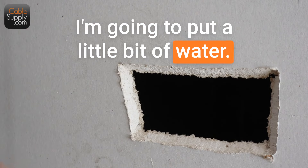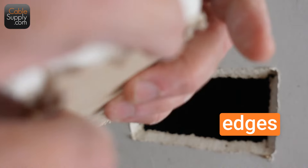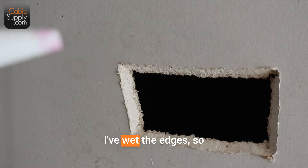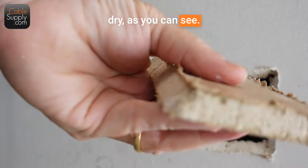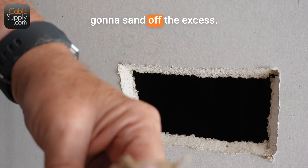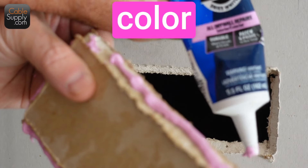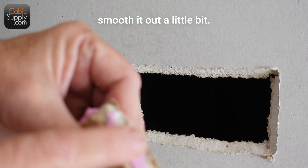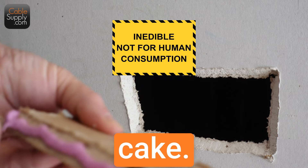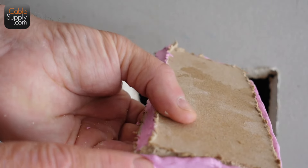Now I'm going to take this and put a little bit of water on these edges. Just a little bit of moisture on these edges, and then I'm going to put a little bit of repair spackling on it. I've wet the edges so they're not bone dry. I don't care if it's messy in this area because I'm going to sand off the excess when I'm all done. I like these little tubes — get them at Home Depot, places like that. I like the fact that it has a pink color when it's wet and dries white. I'm going to take it now and just smooth it out a little bit. It looks like cake filling. I'm just smearing it on those angled corners.